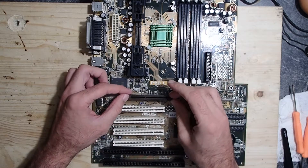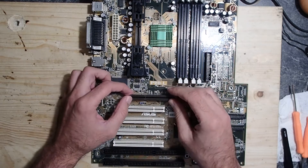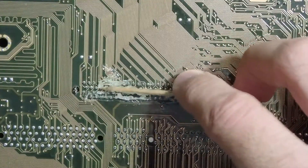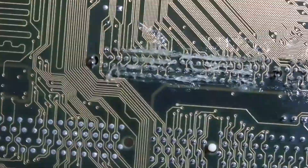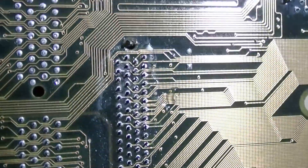I never tried to desolder a part with so many pins before and I thought that it would be a nice ultimate test for my desoldering station. I just added some flux and didn't even have to add fresh solder. The ZD915 just managed to get everything free in a couple of minutes.